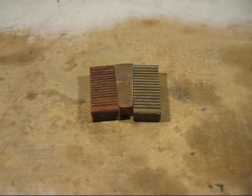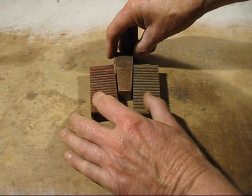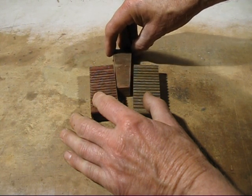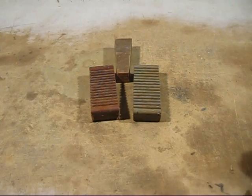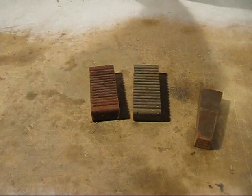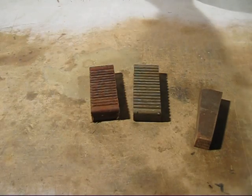Back when I started metal casting, I was shown this idea. You've probably all seen it. Use a wooden wedge, but what I don't like about it, you'll see as you get out to here, you get a lot of play. It's not a real good way to lift the box out and expect the mould to stay in one piece. So this is what I used. I never liked that idea, but I used this. This was a little bit better, but always used to jam.